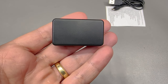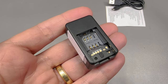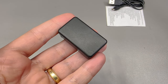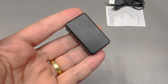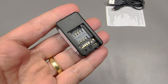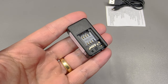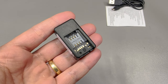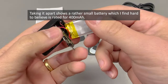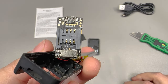Next up I have a very interesting item advertised as a PET positioning GPS locator, model number GF07, and this thing is scary small. The GPS positioning accuracy is advertised as 500 meters, which makes me think it's only doing assisted GPS based on the GSM network and not actually using a GPS module inside. As far as connectivity, this thing will only work with older 2G GSM network technology — it will not connect to 3G, 4G, or 5G networks. The internal battery is rated at 400mAh with 200-hour battery life, which I find hard to believe.